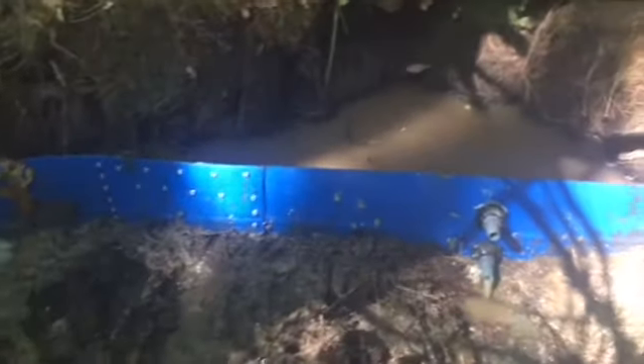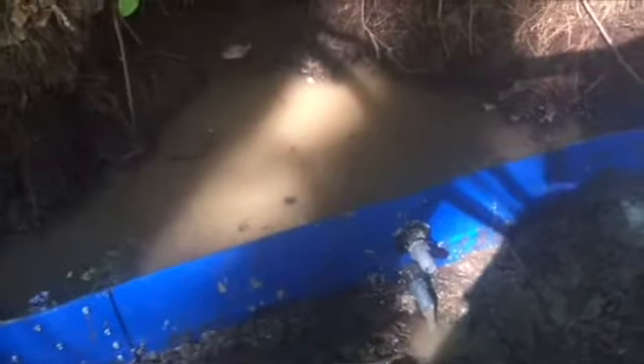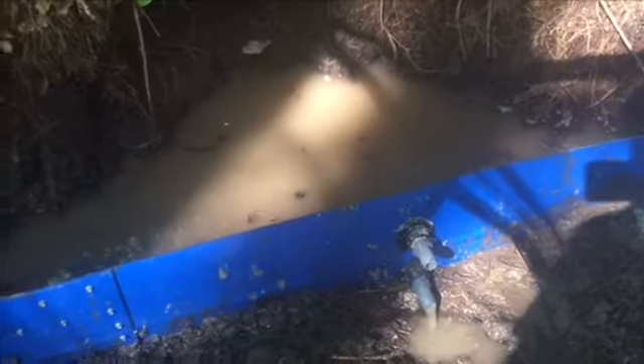What we're going to do right now is build this front wall up because that's where the pressure is going to be, then put rock all in that back end so all the spring heads flow in there pretty evenly. Before I go much further, this is the bottom pipe with the holes in it — we're going to screw that in the bottom, dig a little trench out, and make sure when we put rocks in that thing it's not down around the dirt. We'll get gravel and rocks all the way around it.